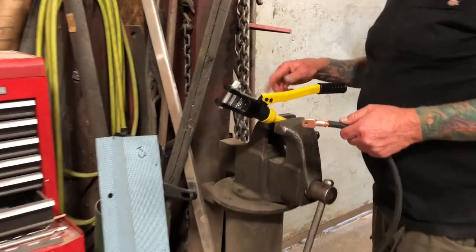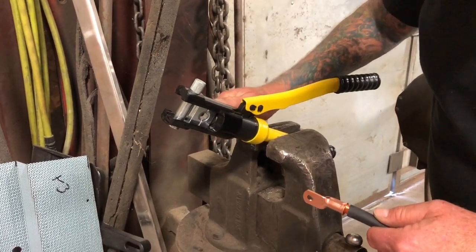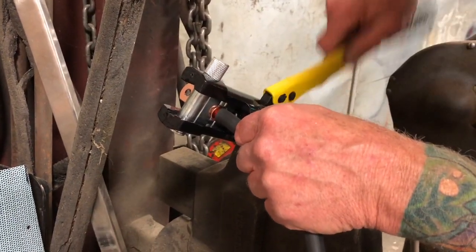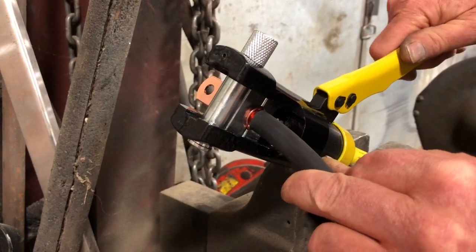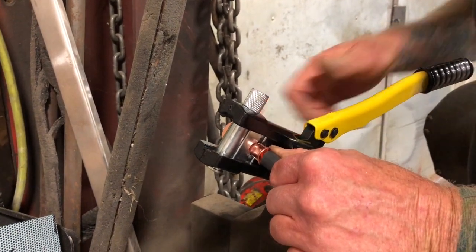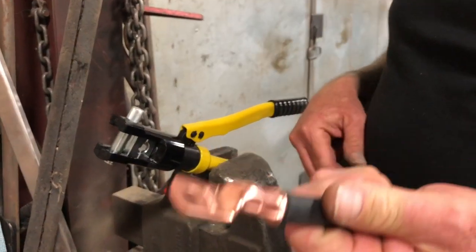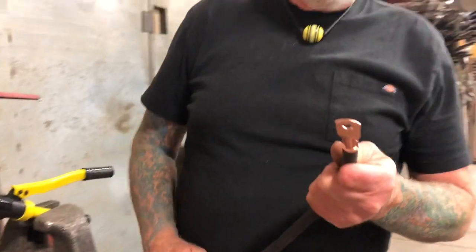I'm putting these lugs on with a little hydraulic press. Just cut these and strip off the insulation, put these on there. I found this really awkward if you're trying to do it in your hand - I couldn't hold everything - but in here it works. The little flange catches on the lug, you close your knob over here and pinch it on there. You have to use common sense because you could break this thing if you tried to do it too tight. I like to scoot over and crimp the rest of it. Then you've got your nice little crimped-on piece.